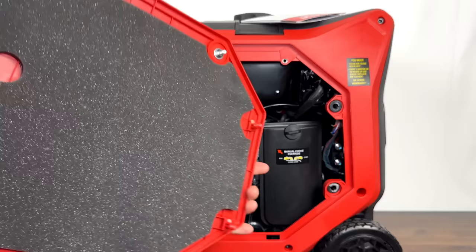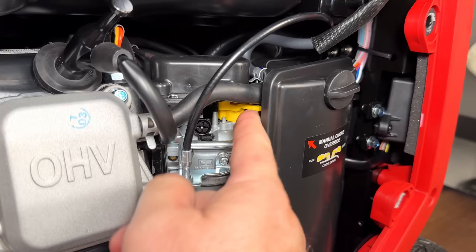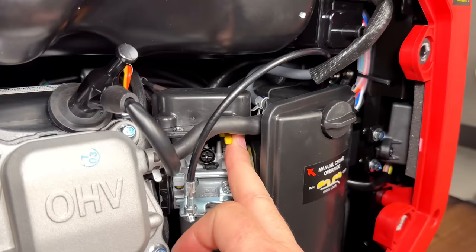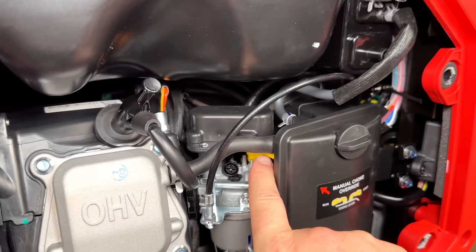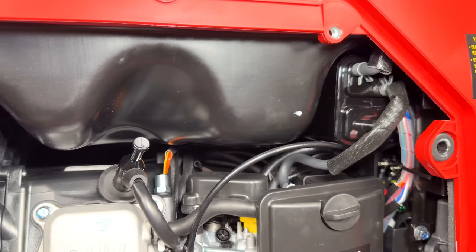Taking a look at the other side of the generator, this panel also has sound dampening foam. You don't need any tools to service the airbox — there's just a thumb screw — and there's also a manual choke, which isn't included on every generator. If your battery is dead, you can pop off the side panel, put the choke in the closed position, fire up the generator, and then open the choke back up. Getting to the spark plug is also easy. This unit will have a charcoal canister included for emissions, which can cause problems if you overfill, but overall the ease of maintenance is very nice.